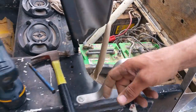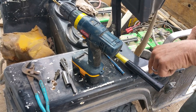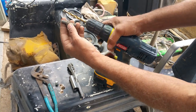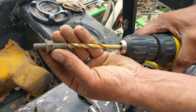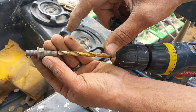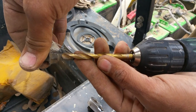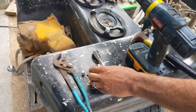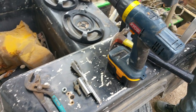The tools we're going to use are a hammer and a punch — that's to start a straight hole at the top — then a drill bit, and the stud. The stud we're going to use is just a hair larger than the drill bit. You want the threads to stick out past the end, just a hair, just so it's bigger. You'll need a socket to drive it down, and an extra nut.